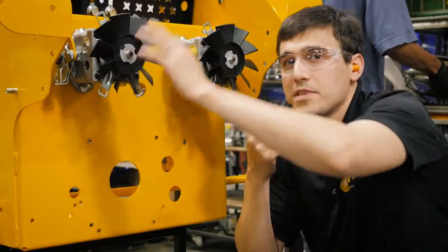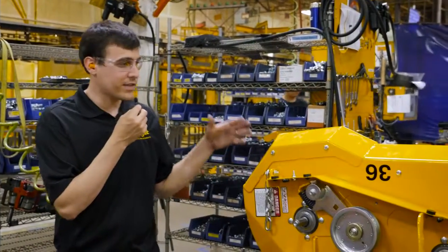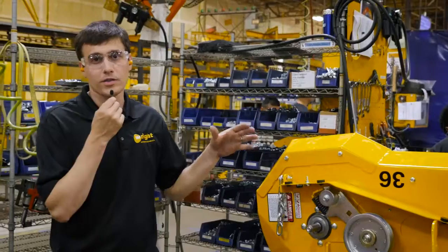This is the first step in the process. Here we install the pumps, the platform. If the mower has transmissions, this is where the transmissions go onto it. So here is where we build up the deck. Here we have a 36-inch deck for Stander intensity. We put on the spindles, blades, idler pulley, belts, labeling, all those kinds of things.